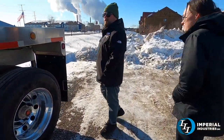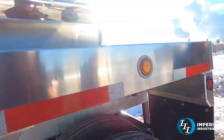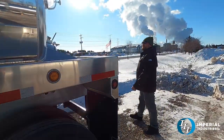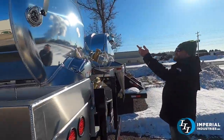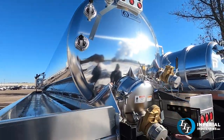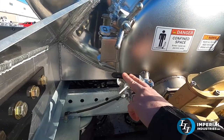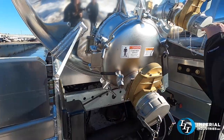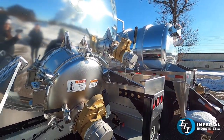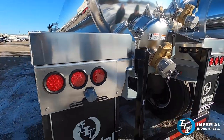All the wiring is done in full conduit, just like on our truck mounts. At the rear, three sight eyes by default, a couple of work lights up top, your clearance lights, six-inch discharge coming out the manway. They did add a sample port — that was put in special. And then you've got your four-inch intake up here, and we can put another one on the side. You can add or go different sizes on the bells, whichever you prefer.